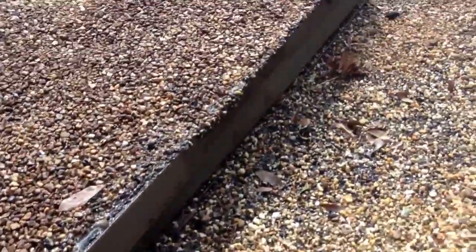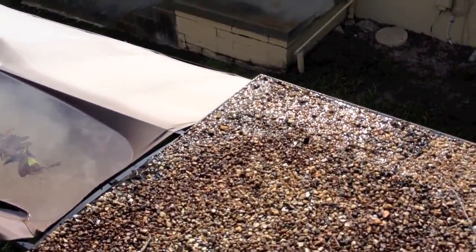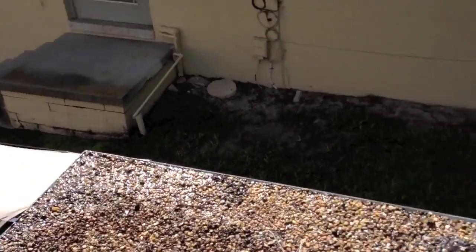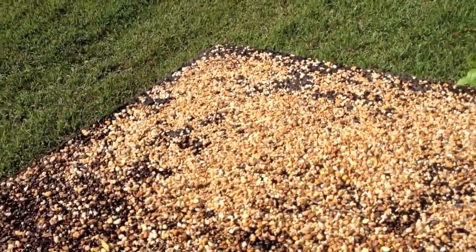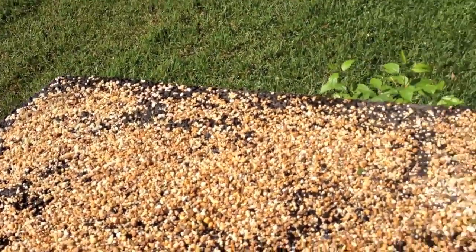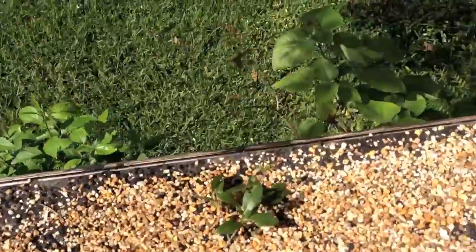Looking at the eave edge on the corner, you can see water ponding — it's not able to get over the gravel stop. There are a couple of locations over the carport area with that condition. You can see the different color aggregate; it looks like a flood coat was applied with aggregate. The sun will break down the membrane and asphalt, leading to cracking and future leaking.